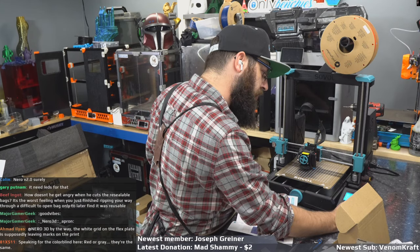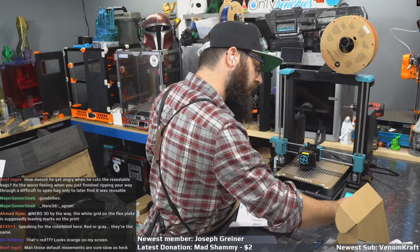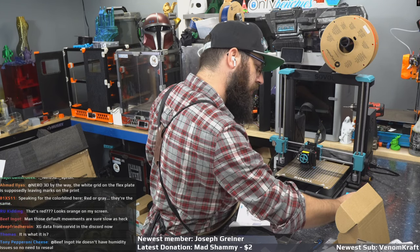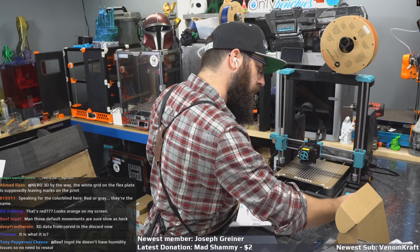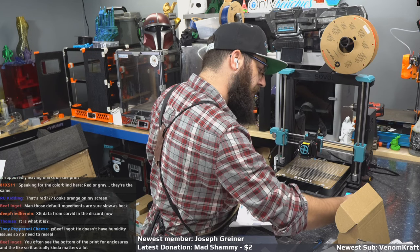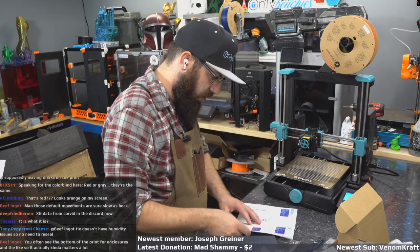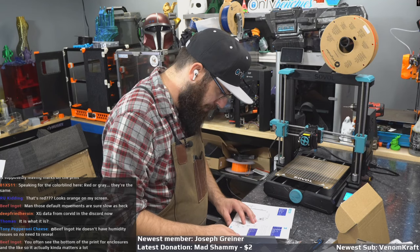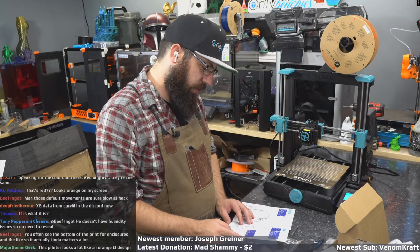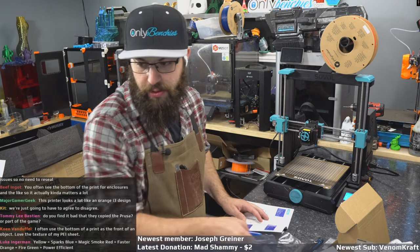Okay, prepare. Move axis. Move Z. Move Z up to, oop, no, 100 millimeters, okay. Prepare, preheat PLA. Okay, so we're preheating for PLA. When the temperature rises to the target filament, cut the front end at a 45, then insert it in the feed port 20 millimeters and turn the wheel clockwise until you see the filament out of the nozzle. Okay. Again, we're following the manual. See what it says.